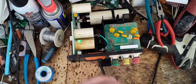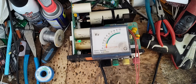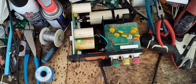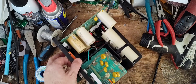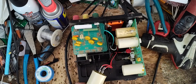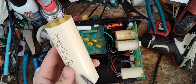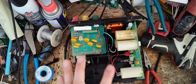I've got a new fence tester I'm having a company make for us — if they turn out real good we're going to start ordering a bunch and offering them for people to buy. Today it's acting fine. Technically she's done, but I'm going to change out the capacitor just because of its age, it's already starting to go down a little bit, and there are those cracks in the shell — there's a big one right there and a couple of small ones too. It'd just be wise while I've got it here to go ahead and change it.